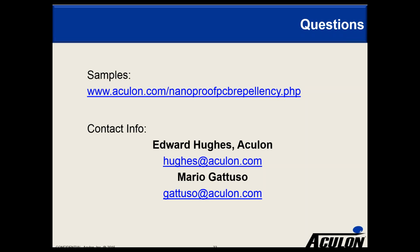Okay, next question is, how do these various treatments compare to parylene? Well, I think we covered a little bit of that in the table, so maybe that question came in before we went through the comparison table. It could have been just a timing issue with the question. Yeah, I think we offer some very significant advantages in terms of the process and the investment. We offer good protection. But yeah, they're different animals. And to add that, there have been some customers who come by and say they've been using a parylene-style treatment and it's not getting the job done. Then they applied some of our chemistry instead of the parylene, and it tends to work. It seems like the device architectures sometimes cause parylene to have difficulty for whatever reason. That's correct.